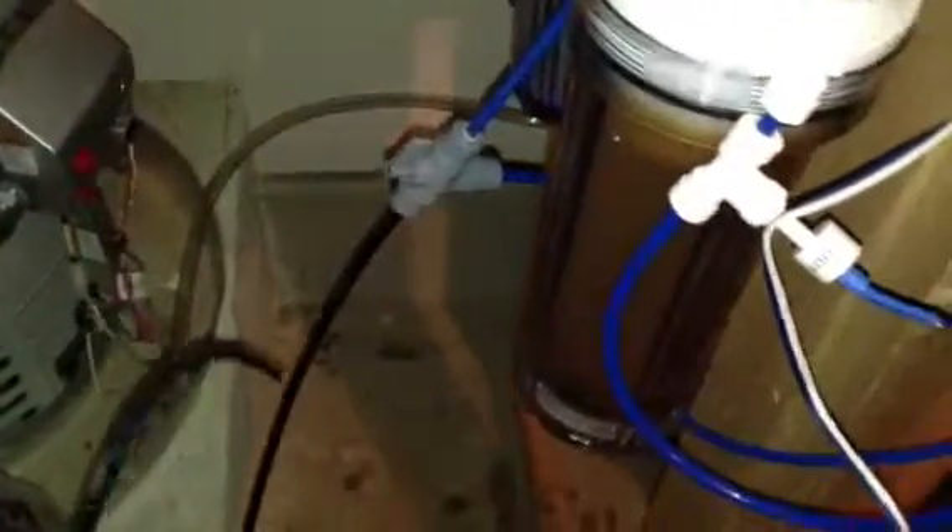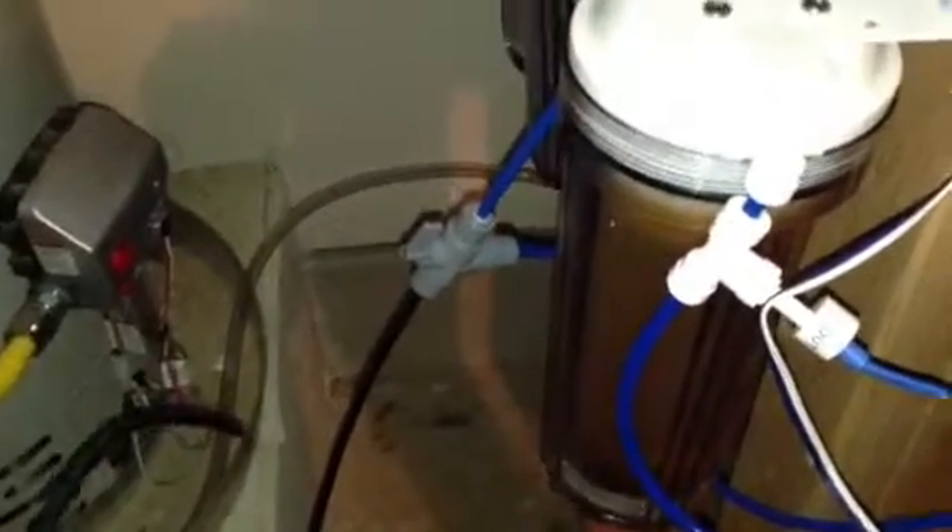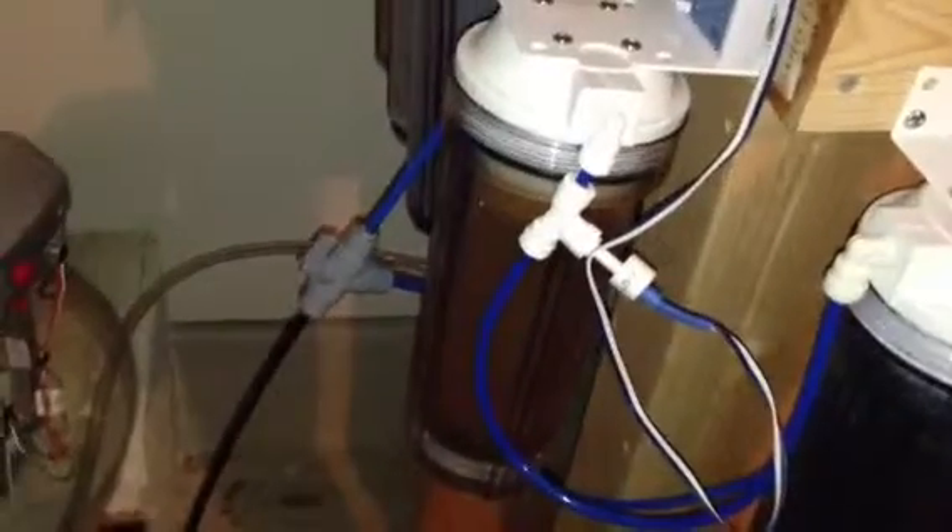That's it. I made this black so it matches the waste line so I know what it is, and this took me 20 seconds to do. Technically I could put the TDS meter before the diverter — zooming in right here — and turn it on while flushing so I can read when it's at zero. I suppose I could do that, but I don't know. So that's it — I just have to splice this in, and that is how to prolong the life of your DI resin. Thanks for watching.